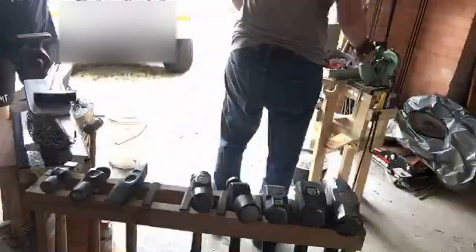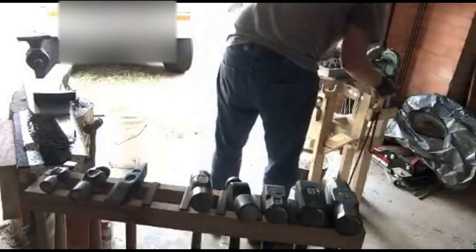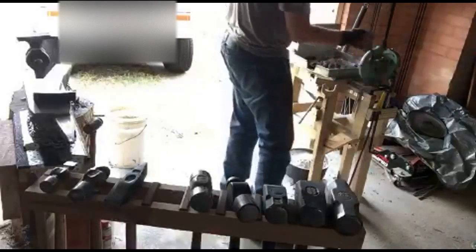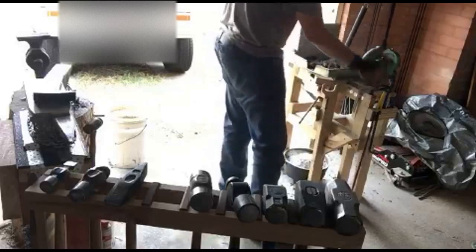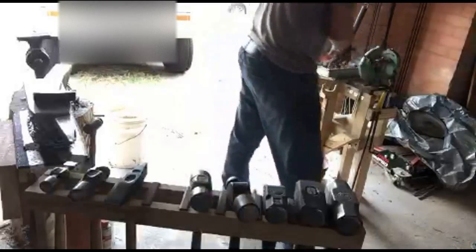That actually wouldn't have happened if you were using a carbon steel, because we're using just mild steel. It's easy to move, but because it's kind of soft, you can form cracks with it easily. Every time you hammer the steel, you're potentially weakening it more. If you're not hammering on it while it's orange or yellow, you're stressing it, and when you get to thin points like that, it can cause cracks.